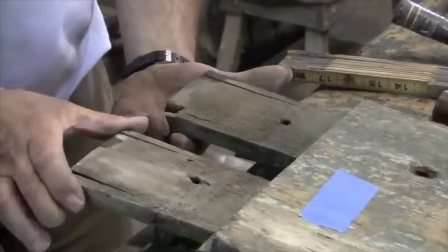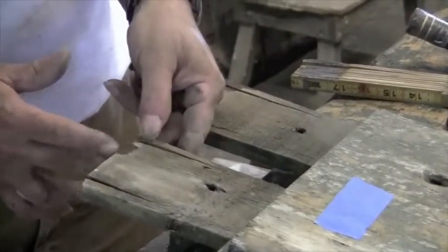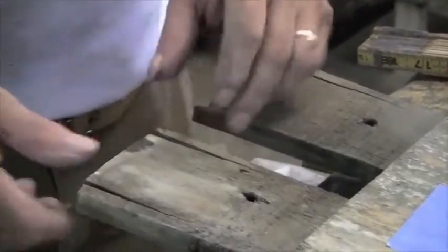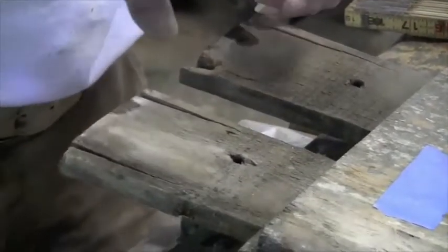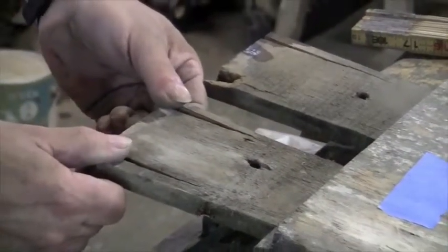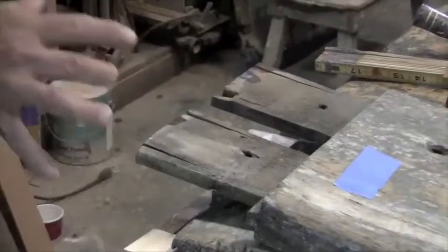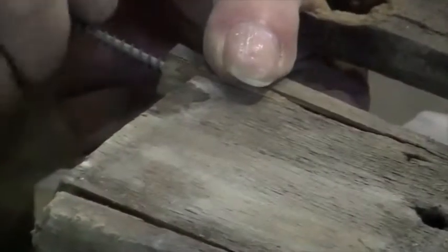They slid the tenons into the mortises when they originally made the door, and then drove a chisel in and split the tenons slightly, and then drove wedges from the outside into those splits and expanded the tenons on the outside edge, making kind of that dovetail sort of effect, so that even with the pegs and all of the tension of the fitting, these wedging out and spreading on the outside edge meant that that tenon could never draw out. To take the door apart, I had to find those wedges, the ends of those wedges. Sometimes a matter of reading the grain, but I'd drive the screw into it and then yank on it with a pry bar, and out it comes.